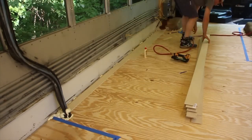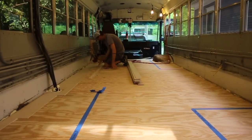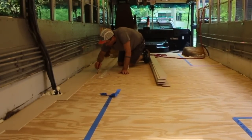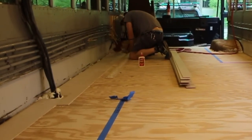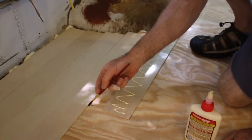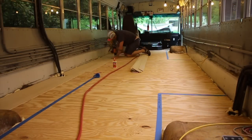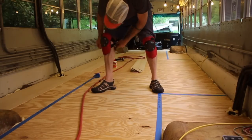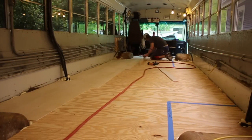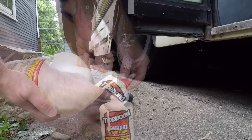On the next row, after that first one was laid down, I only did one thing differently — and I did this for all other rows — and that was to apply a bead of glue to the edge. You don't need to gap plywood flooring because it has layers running different ways and doesn't expand or contract. So I glued my boards to each other to get a really tight fit, and fewer nails means filling fewer nail holes later. I got some help at the saw for much of the project. It goes much faster with one person cutting and the other laying down the floor, though you can do both jobs yourself. I went through about a gallon of glue, so plan ahead.